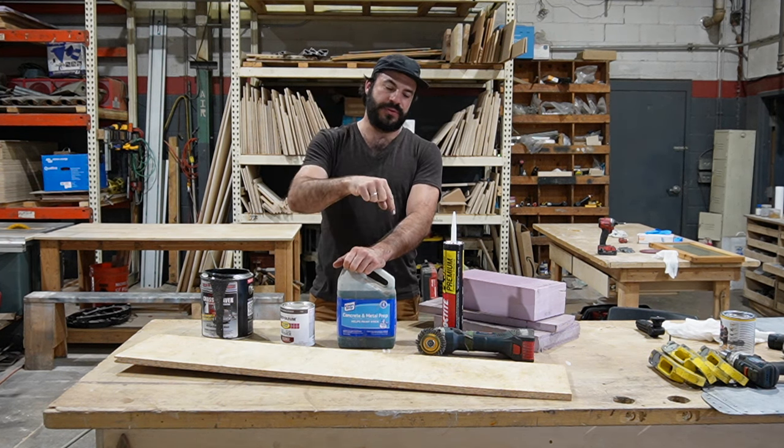There's another foam board product on the market that does have a higher R value per inch than this. So this has an R value of 5 per inch. There is a product out there called polyiso or polyisocyanurate board, which is oftentimes used in roofing. It has an R value as high as 7 per inch, but there is a trick to that, because that R value, and this is the only insulation I'm aware of that does that, it actually goes down as the temperature decreases. And it goes down so much that by the time you get to the point where the insulation in your floor is really gonna matter, it is at an R value that is actually lower than what this has. So it starts at 7, but I think by around 30 or 35 degrees,